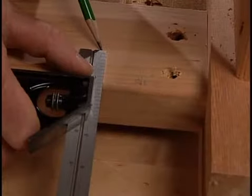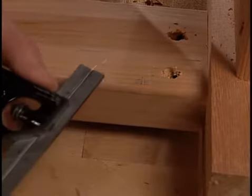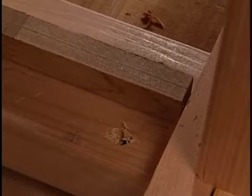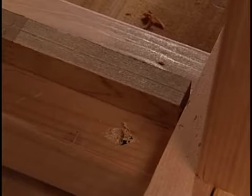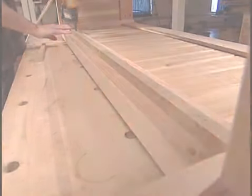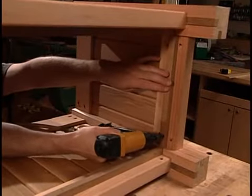The bottom of the box rests on 3/4-inch square cleats, nailed 1 1/4 inches up from the bottom of the rail. Cut sections of 3/4-inch square cleats to the inside length and width of the 4 rails. Fasten the cleats with stainless steel brads set about 6 inches apart.